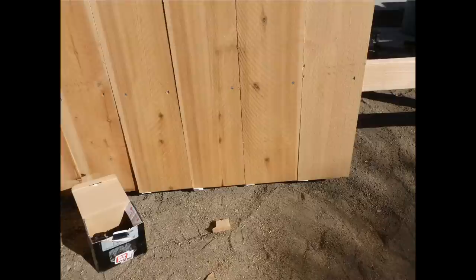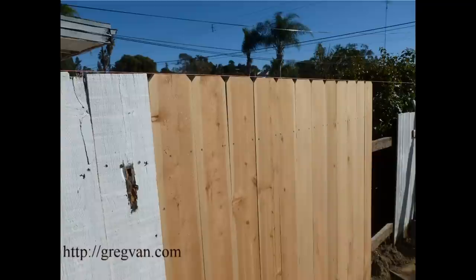Here's a quick tip for anyone who's going to be putting up fencing — 1x6, 1x8 — if you go down and pick it up at the lumber yard and it's fresh wood that hasn't dried out, it wouldn't be a bad idea to place all of them as tight as you possibly can together, because they will shrink.